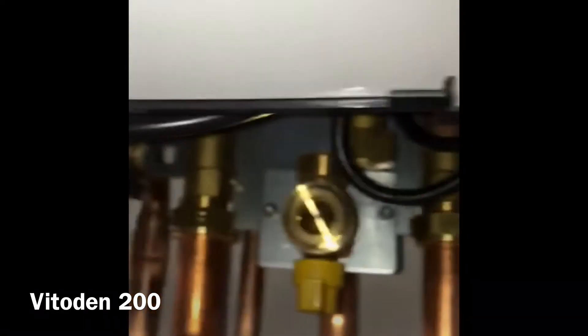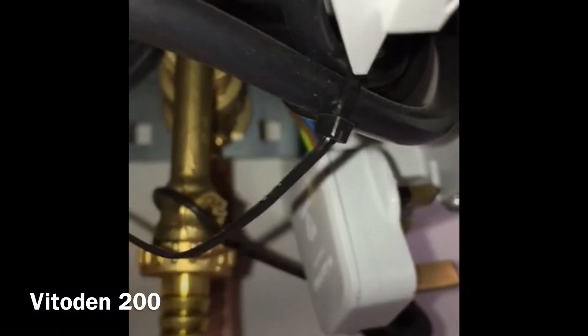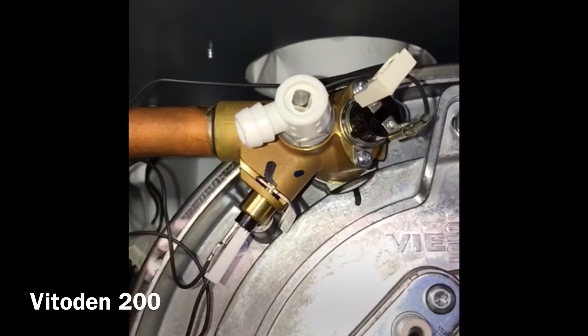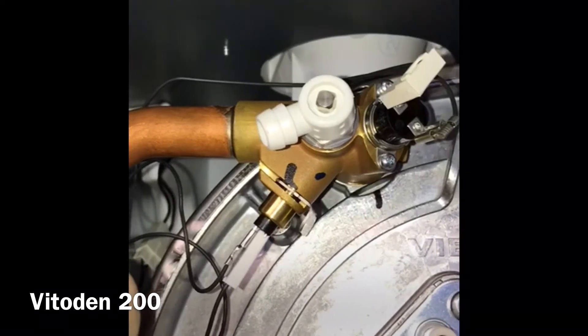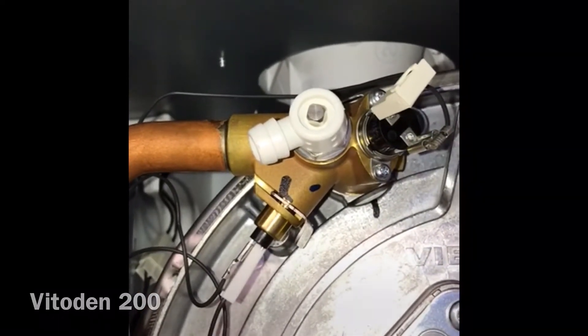Isolate underneath, put a hose pipe on, turn the isolation valve. You've also got a drain valve on the heat exchanger so you can use that for filling and purging the system, or to drain down the heat exchanger and take the pressure out of the boiler.